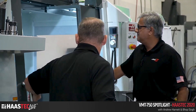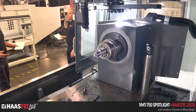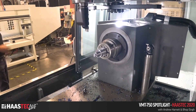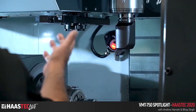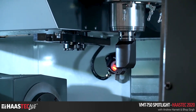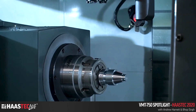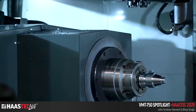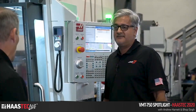What makes me excited about having a live tool inside a mill spindle is that I'm never worried about neighboring tools getting in the way. On a regular live turret, you're always worried about tools hitting the jaws or the chuck. This tool is all by itself in there — no turret, no neighboring tools. Plus, on a live turret you're restricted to how many tools fit, maybe a 12-station turret. Here we've got 50 tools, and no clearance worries. You can build up a big tool magazine and run a large range of different parts without setups.